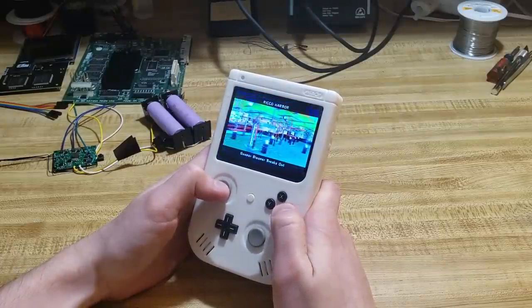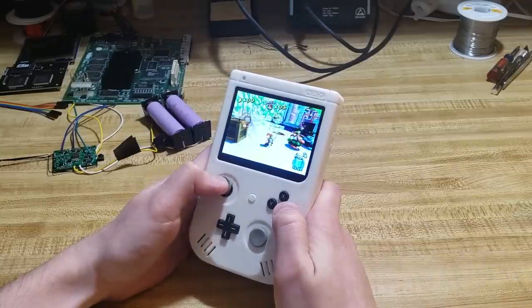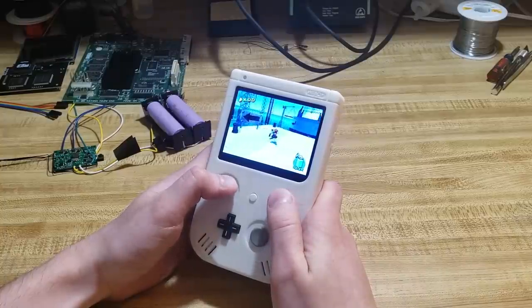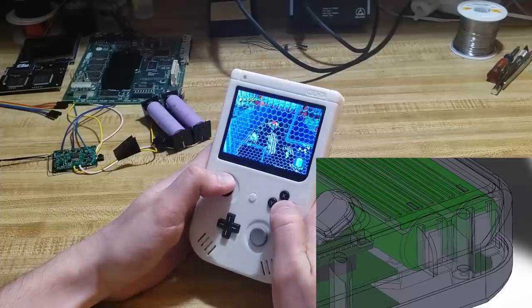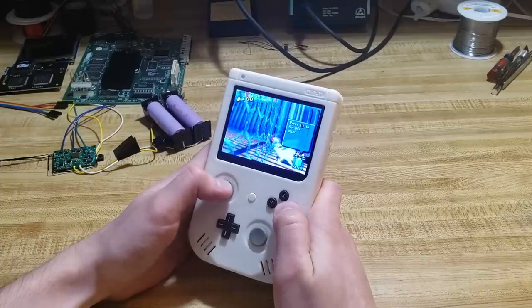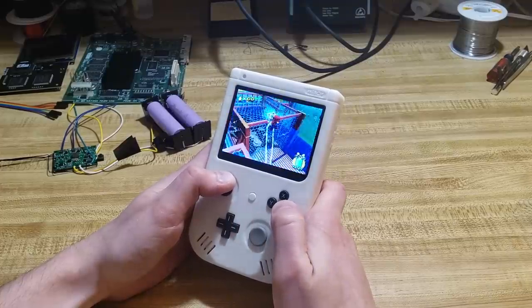The USB-C power delivery is made using the STUSB4500 IC, which autonomously handles the power delivery negotiation. The chip takes a complex feature and makes it very easy to integrate. In addition, there is a USB data multiplexer switching the USB drive seamlessly between the USB-C port and the Wii. The batteries make contact using clips which slide into the case, and only a few drops of glue were used to route wires. Everything else is mechanically secured using screws, making it cleaner and easier to assemble or repair.